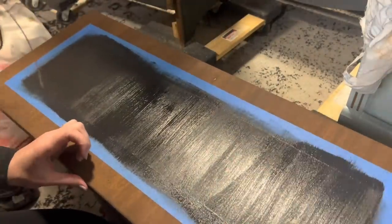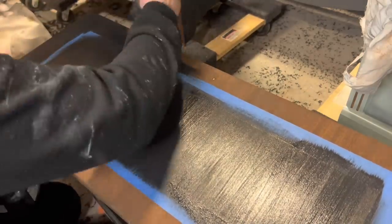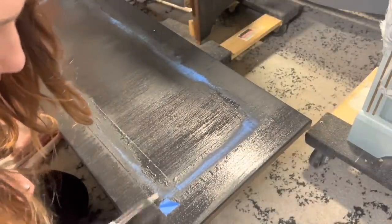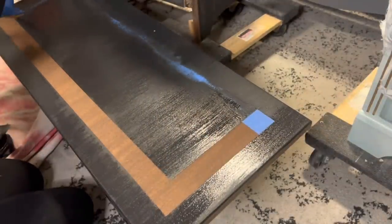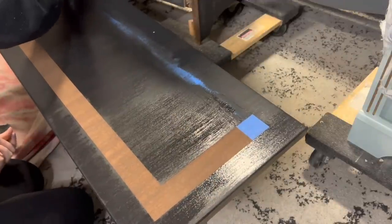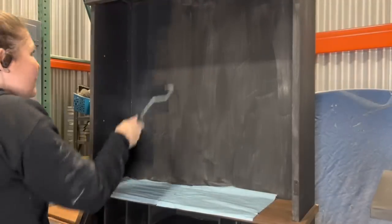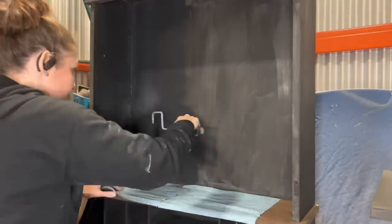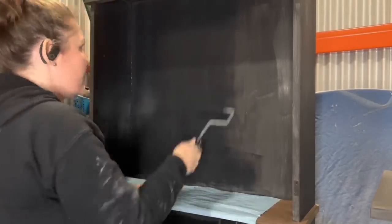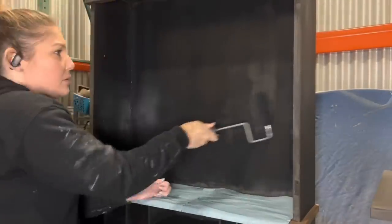This is a really strong grain, so I like to keep the brush strokes going in that direction. You'll see me lay it on in every which way, but then I'll go back and smooth it out with the grain of the wood — I feel like it looks better, it's a better end result. Tape does give you this satisfying crisp line right there. I couldn't have done this with a paintbrush freehand. On this part, I pulled out my roller and went so much faster. I did a brush on my first coat and was like, I have a roller, why am I not utilizing it? So I definitely did that, and then took my angled brush — no tape — and just did the cleanup around the edges.